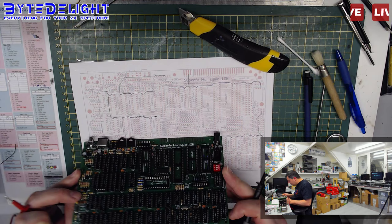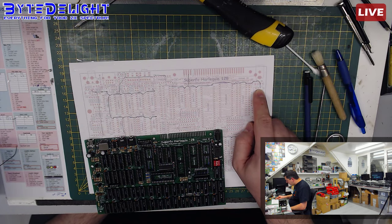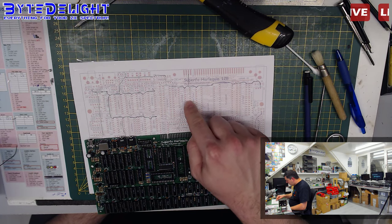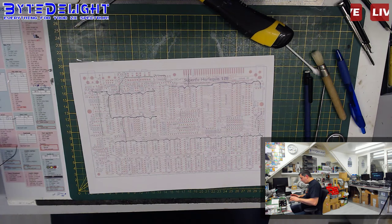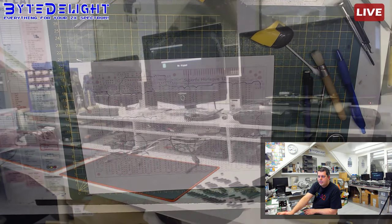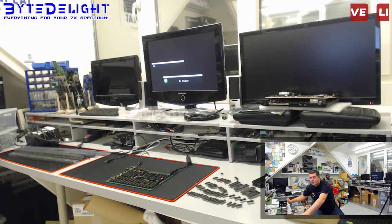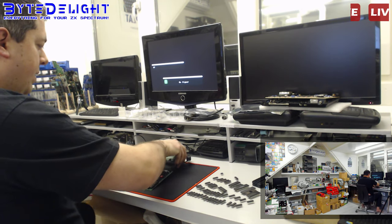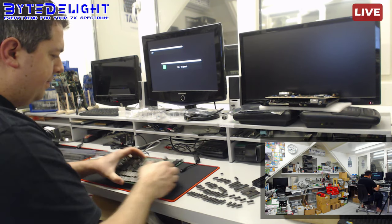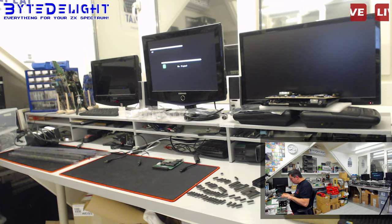All right, that's okay. So let's do another test, and we only at the moment have a connection between the 5 volt output of the regulator going to the right RAM chip, the ROM chip, Z80, and this HC245. Not anything else. So we want to check if the board is still not powering up completely. Let me check on the other side again. So, still no 5 volts. What the hell is this? Okay. So I'm getting more puzzled by the second.